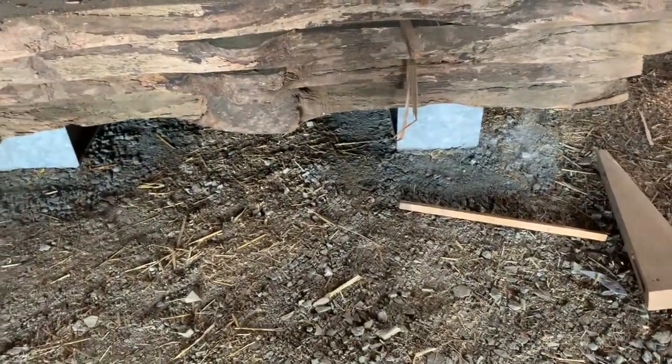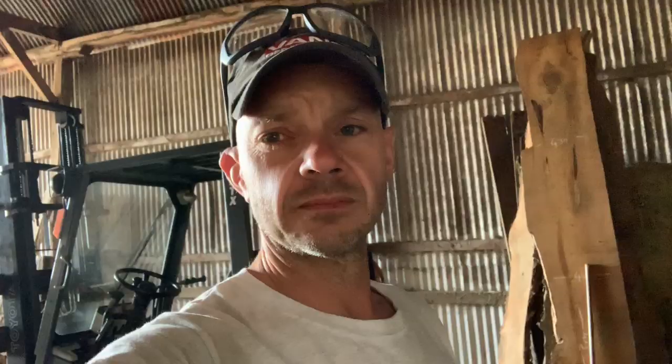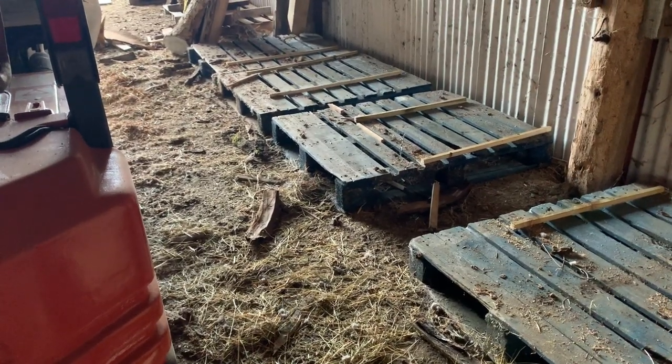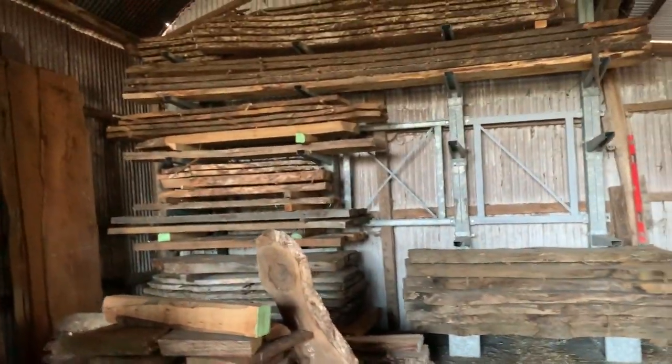I'm really pleased with it — it's totally solid. I put a base in using some scalpings or type 1, whichever you call it — 20 mil to dust — and sprinkled some cement in with it as you go, and it goes rock solid. This obviously needed to be perfectly level. If you had a concrete floor and the building was all flat and level, you could stack your slabs up on pallets and on the floor, just playing around with a forklift, and save time on racking. But the problem I've got is this barn is not level, and investing thousands into a concrete floor and trying to get things level is really hard and slow.